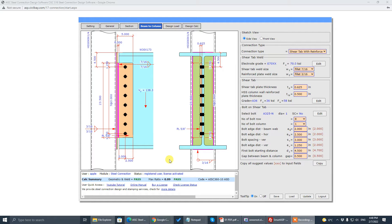In this tutorial, I'm going to show you how to design the slip-critical connection in our program. For bolt shear capacity checks, there are two types: bearing and slip-critical. Some applications require slotted holes and need a slip-critical check. For connections subject to cyclic load or vibration load, the engineer also specifies slip-critical connection. For all moment, brace, and shear connections, there's a bolt setup button.